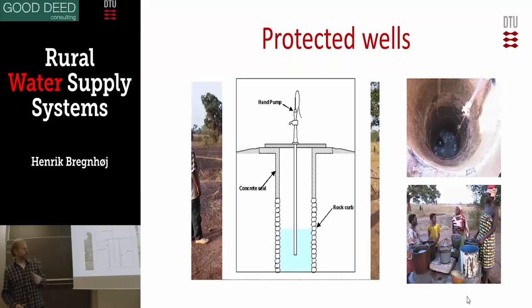The way you dig it is during the dry season — at the end of the dry season — you dig the hole as low as you can. It could be that you have bedrock, so you have to stop somewhere. But at least you're digging down to the water table and two meters more into the water. That would be the standard for making a dug well.